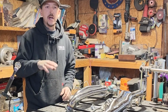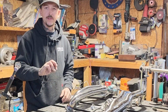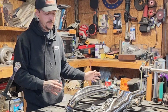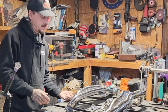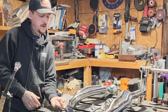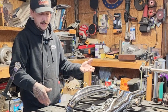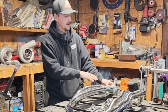When I back purge, I generally turn my gas flow to about 5 CFH, and then I'll back it down to about 3 flowing. As it's flowing, you do want to have some kind of vent in this thing. So what I did was I just left one small hole on each end of the runner, a small pinhole in the foil, which will allow this thing to fill up and fill those runners up and still allow it to breathe out, so that we make sure we get all of the oxygen out of this thing, because that argon's going to flow through here.